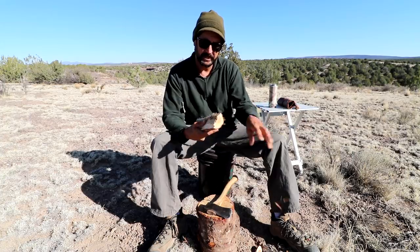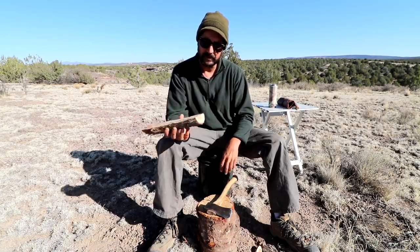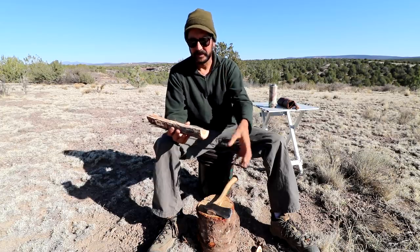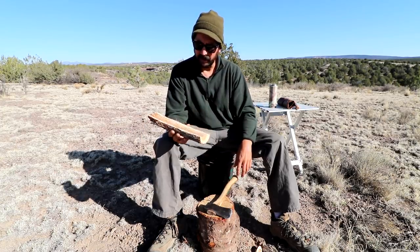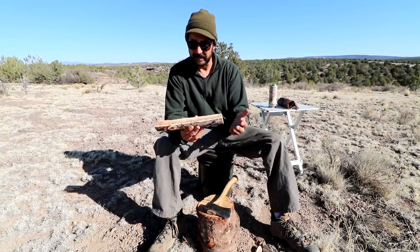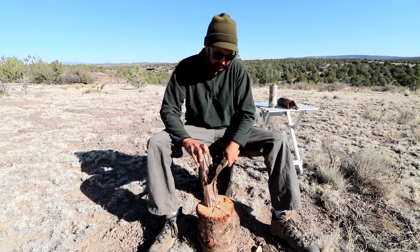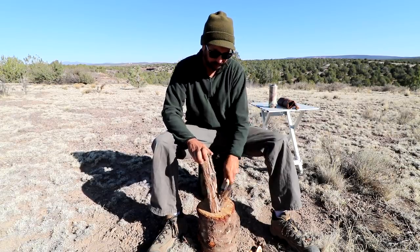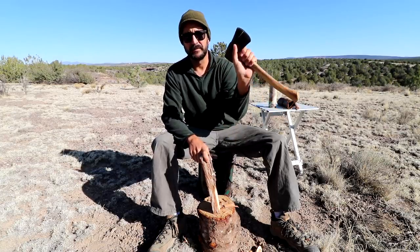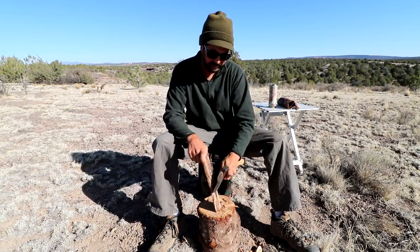This wood is still pretty green — meaning it's still fresh and wet, not dried. That's the kind I prefer to work with because it's much easier to carve. If I let it dry first I'd get a lot of cracks and checks in it, and those cracks would end up in the spoon. Once you carve it and it dries, there's less wood mass around so it tends not to crack. When using an axe in this fashion, choke up as far as possible — I've got my thumb on the edge of the head and use very short strokes for a lot more control.